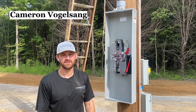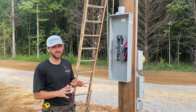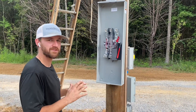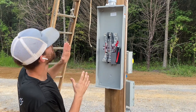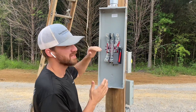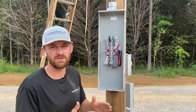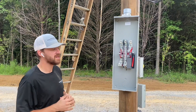Hey everybody, this is Cameron Vogelsang with Tennessee Electrician, and today I'm going to show you how to do a 400 amp service. The first thing you want to do is mount your meter base. You always want to get your meter base where the meter is at eye level. We already mounted it, and a lot of times when you mount the meter base you can't always get it level — we have an issue here where the telephone pole is not level, it's kind of going up crooked. So for the riser to work out how it should and not go off the pole, we usually just tilt the meter base to however the pole is going.